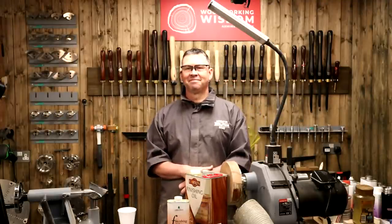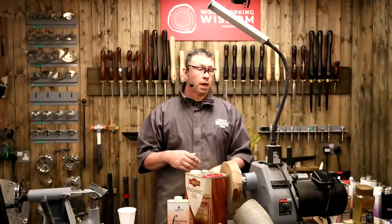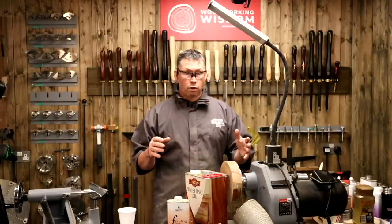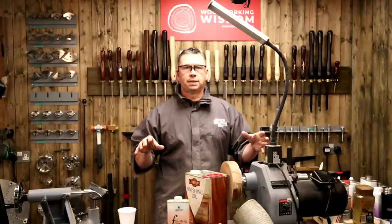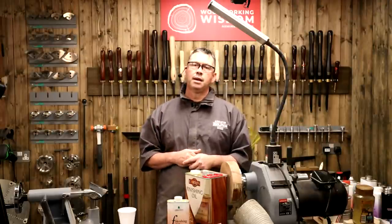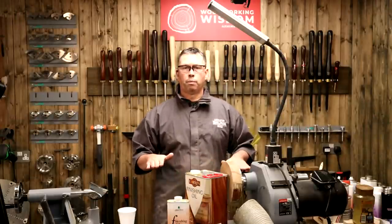What would you recommend to seal wood prior to doing an epoxy pour? Good question. Epoxy, that's the thing. So you seal it with epoxy. In fact, I was just doing one last week. So you make sure your mold's done, absolutely watertight. You fix your pieces of timber down. You mix up your first batch of epoxy. That's enough epoxy just to cover all of the timber and the void, so the bottom of the mold, basically.